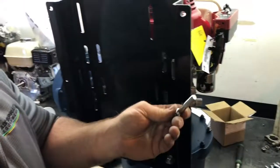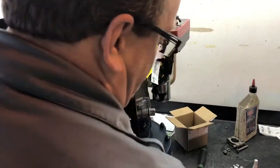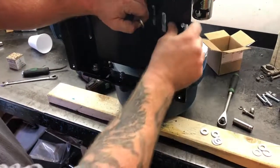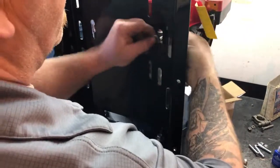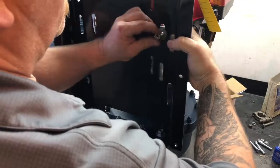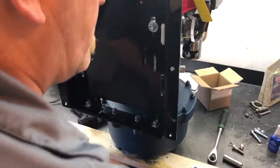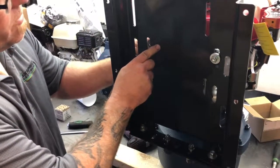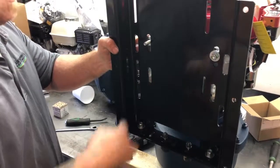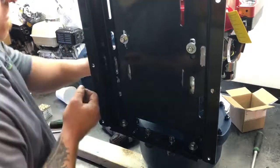Then you have these. Steel, not stainless steel, just standard zinc plated 3/8 nut. They're bolts. I always double washer them on the bottom. These holes are slotted out quite wide. They just come through the base of your pump like that. Then there's 4 of these. I do believe these are 1.75 inches long, so that they are long enough to get through the plate. Remember to put washers on the top, 2 washers on the bottom. Put this one through.